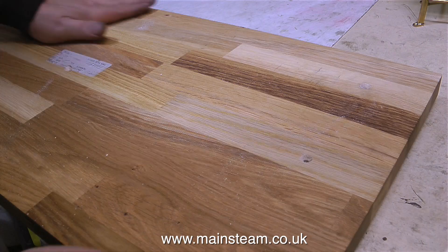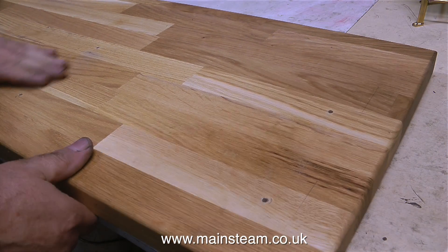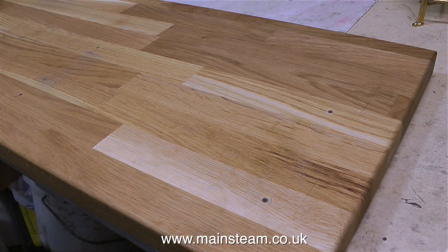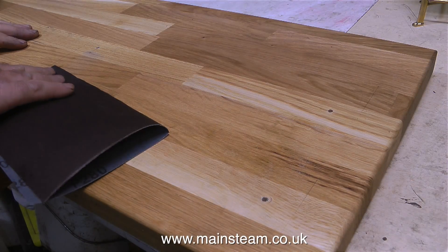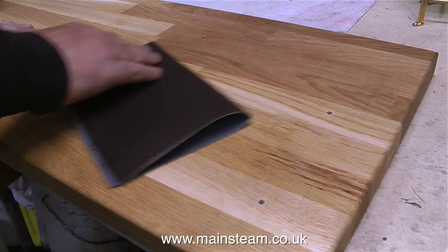This is a really nice piece of wood and it's going to look great with all the parts mounted on it. But unfortunately it's not waterproof and it's not oil proof. I've noticed that any spots of oil that got on the wood stained it. So before I finally fit everything to the board I'm going to rub it down with some sandpaper and wipe in some polyurethane varnish, hoping that will prevent any staining in the future.